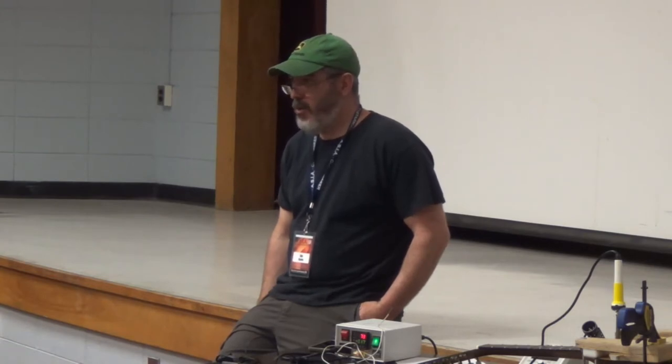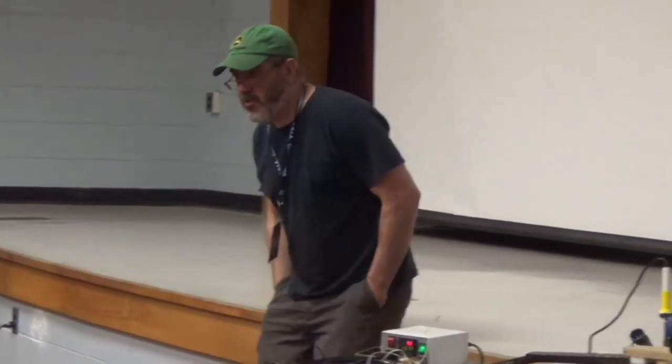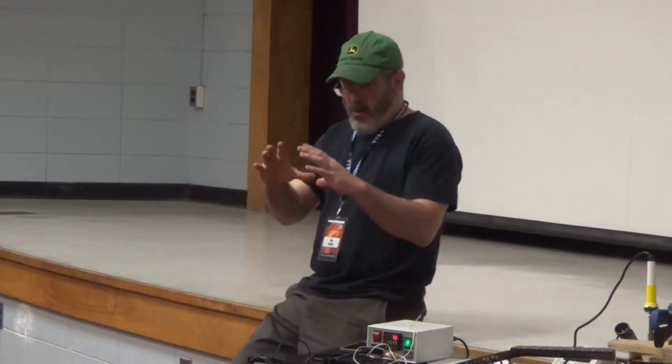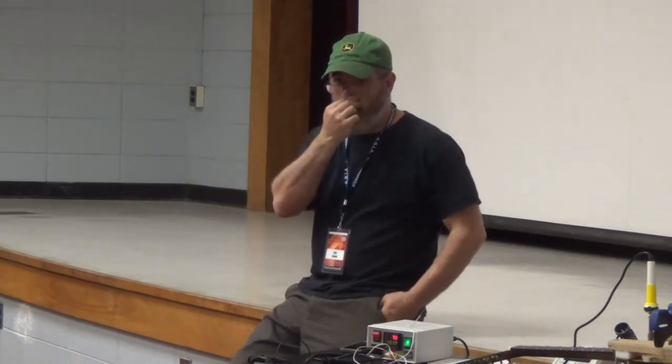The first neck I pulled with that was, I think, a 60s triple O, and it was hide glue, and it came off in probably about 15 minutes. And cleanup, essentially what it does is it turns the neck joint into a glue pot. And so when the neck finally releases, cleanup is basically just turning the guitar upside down and letting the glue run out of it. And at that point, I walked around the block and I laughed for probably about an hour. I was just laughing.